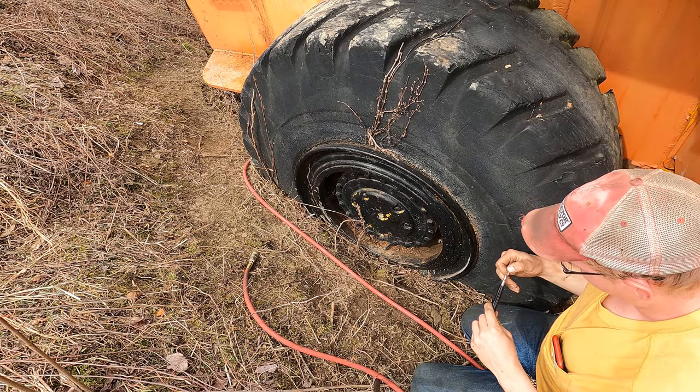I said, I got no brakes, and to get this thing home, I got to go down a couple pretty good hills. So this is a really good test right here, just seeing how this thing slows down and holds itself back in just first gear. I've run a bunch of these old loaders on farms and junkyards and everything else that don't have brakes, and they never fix them. The systems are often pretty complicated, air over hydraulic, and pretty problematic.